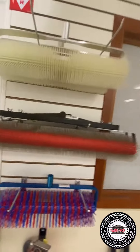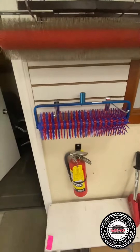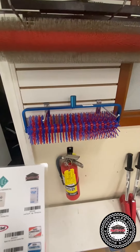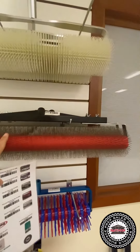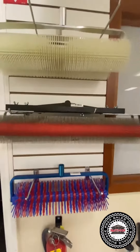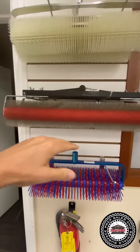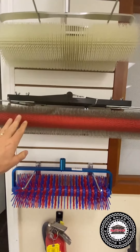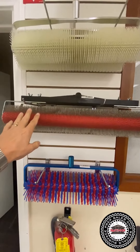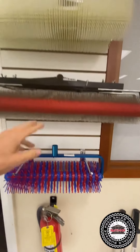Definitely want to use that metal roller for the True Gray or also for the concrete leveler. You want to use the metal spike roller. So if you've had those bump effects — those hole effects where you see the roller mark effects in the concrete leveler or the concrete gray — you're using the wrong roller. So just a helpful tip: on the True products with aggregate, use this one; without aggregate, use this one.